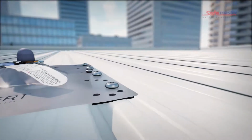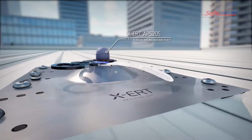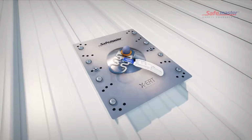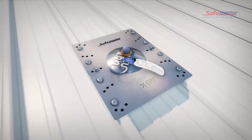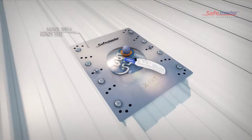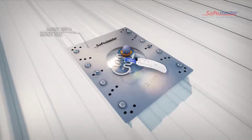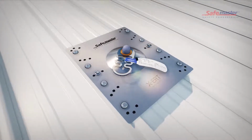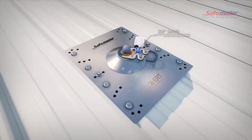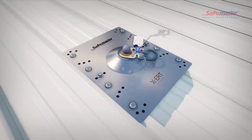Surfacemount ERT APS205 Surface Mount Fall Prevention Anchor Point is for use as a single or two-person anchor point, primarily designed to be fixed permanently to buildings or structures with metal deck roof sheeting. Designed in accordance with Australian and New Zealand standards 1891.4 and 5532. The 15 or 21 kilonewton anchor point incorporates an energy-absorbing multi-directional 360-degree swivel attachment point, which greatly minimises injury to the operator. It can be used for both fall arrest and fall restraint applications.